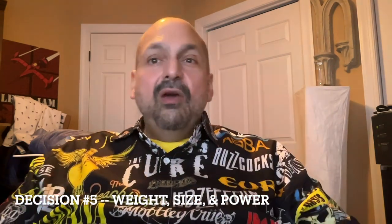Decision number five: weight, size, and power. Generally speaking, the larger the speaker, the better it sounds — especially for deep bass. Some smaller speakers sound really good, but most are easily driven into distortion, especially with deep bass or high-frequency treble. Most small speakers sound best in the mid-range at moderate volumes. Speaker power is usually expressed in watts — sometimes as RMS, sometimes as peak. RMS is the one that matters. If they give you peak, divide it in half.